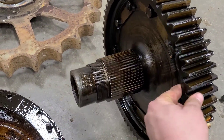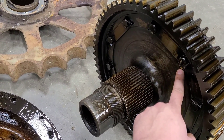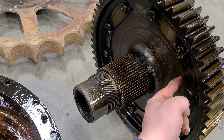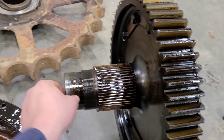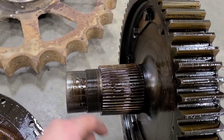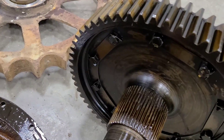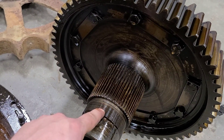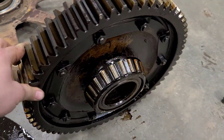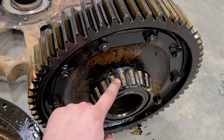I'll jump over to this gear here. The gear itself is bolted on to the inner part of it, but that is still one piece. I don't believe that's a weld — they machined it down, because the machining marks come all the way in from out here and work their way in to a big tapered spline. It is probably about four inches around or so, but obviously you get into the D6s, D7s, D8s and on up, that gets a lot bigger. These are the threads that that nut was on, and the outer bearing rides here, your inner bearing rides there. I believe all this can stay together — we'll just clean it up as is. Bearings don't look bad, don't feel bad.